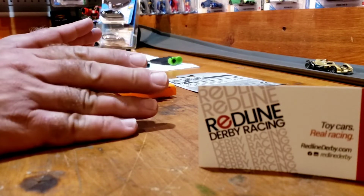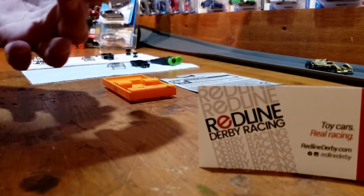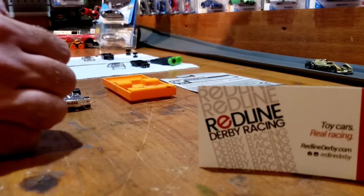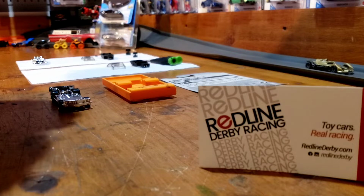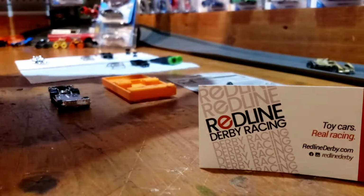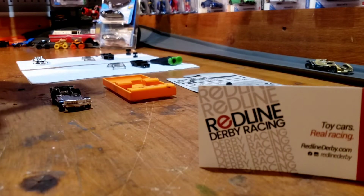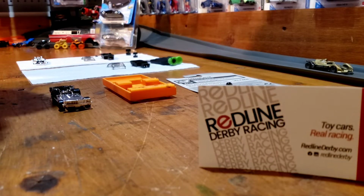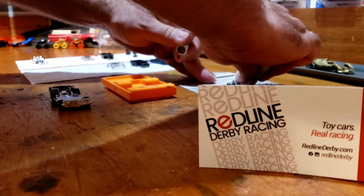I figured out where it needs to be. So now what I'm going to do is take it off and turn it over. I use JB Quick, and it's just the same amount of each, a little bit. It doesn't take much for doing this. So I'll put a little bit of that, that's the actual steel. And then what I'm putting now is the hardener. This is what makes it actually get hard and bond.